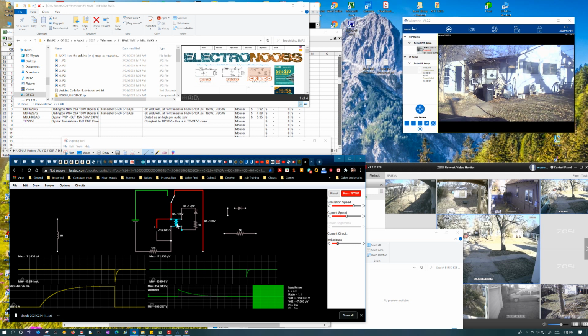Just like this, an air core inductor is going to store energy in that magnetic field, but only in that magnetic field. But since we have a core in it, it's storing energy technically in that core, too. That's why you can switch coils. You can't switch coils in an air core inductor very easily. In theory you actually could, because you could have a bifilar wiring or something like that, and pick up on the secondary what went into the primary. In theory it could work that way too, because it doesn't store it in the copper any more than it actually stores it in the magnetic field technically.